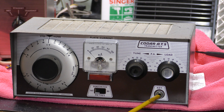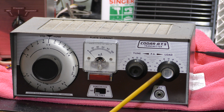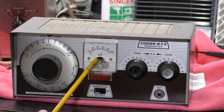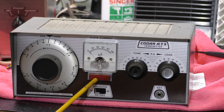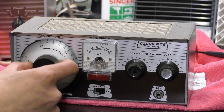Here's the transmitter, and there's a key connection at the front for a Morse key. This is your Pi network. Looks like I'm missing one of the little silver bits for the knob, unfortunately, but this is how you adjust the loading. There's your meter for adjusting resonance and checking your current. There's a neon which indicates modulation level so you don't over-modulate. There's a band switch that switches between an amplifier from the VFO or a doubler to get onto 80 metres. And here's your gear dial for adjusting your transmit frequency.